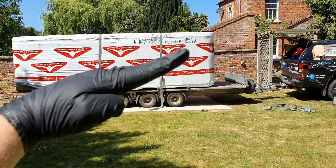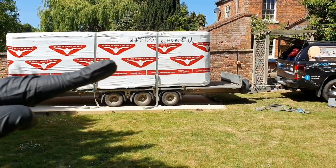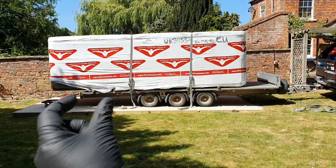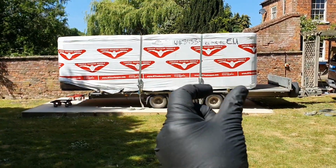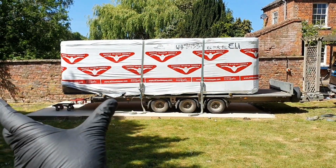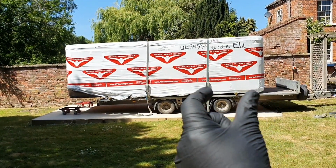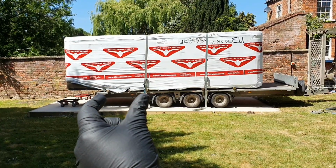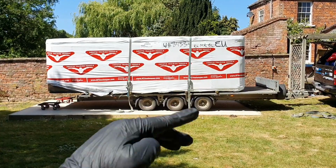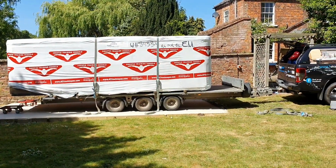As we do that, the spa will stay where it is, and the trailer will move out until we have roughly a quarter of the swim spa left on the back. As we're doing that, some of these rolling beams will fall out, don't worry about that. Once we've pulled forward and we have maybe just this part on the edge of the trailer there, then we'll be placing the swim spa lifting log underneath to lift the load clear of the trailer to allow the trailer to be pulled clear.